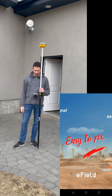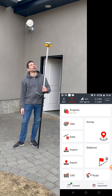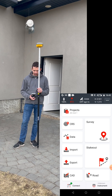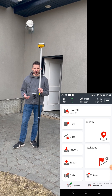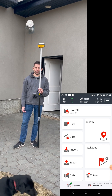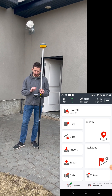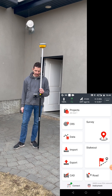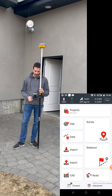As you can see it's starting to load — the C5 is already connecting. Once I open up the eFIX software it's going to try to connect to the C5, and since I already have everything preset, it did connect. As you can see, I'm already fixed within just a second and I'm up to 31 satellites tracking.